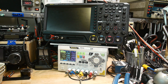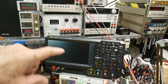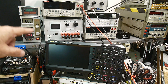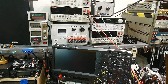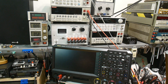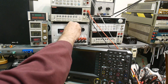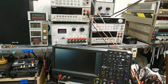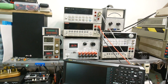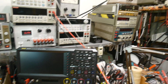I've also rearranged above the bench a bit. Since I got rid of that big Hewlett-Packard/Agilent power supply, I moved my old power supply over — it's a really handy supply with a whole bunch of fixed rails: plus 5, plus/minus 12, plus/minus 15, all preset, no fan, so it's very quiet. It also has one adjustable rail handled by a knob. I've slid everything left a little so my meters and Keithley are more within arm's reach. I think it's a better layout.